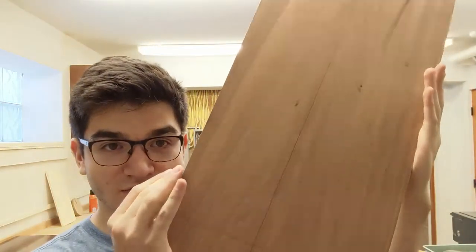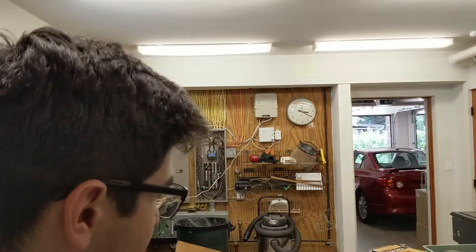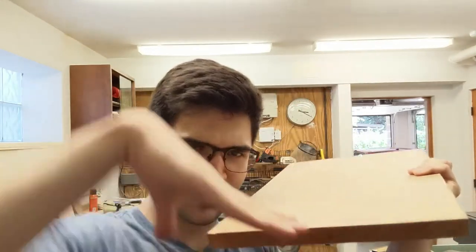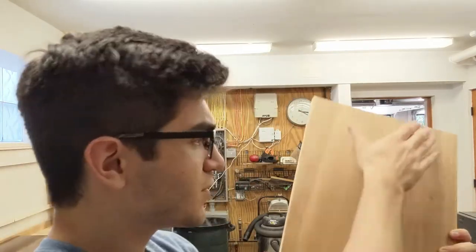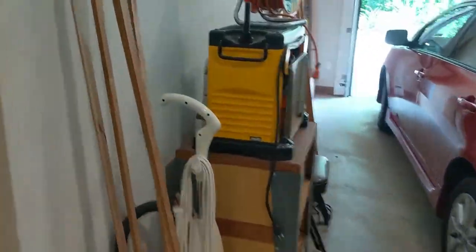Here's something exciting - this is the cherry that's going to be on the back plate. I have my center line marked out. You want the grain swooping this way relative to the curve - the annual rings go like this and the arch of the violin like this. The spruce for the top is already glued up, so everything's looking good.